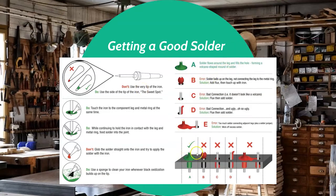A good solder joint should look a little bit like a Hershey's Kiss — the solder goes up the side of your component and down into that hole and fills it well, giving you a really good connection. You don't want a solder ball sitting on top, because it's not hitting the metal ring and the electricity isn't going to flow to complete your circuit. You also don't want a joint that's really flat or incomplete — you're going to need to add more solder. And you don't want something uneven like that either, as it's not going to give you a good connection.